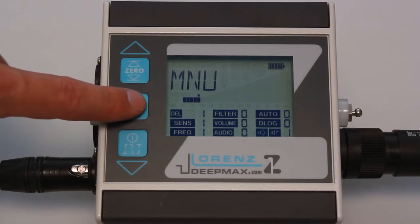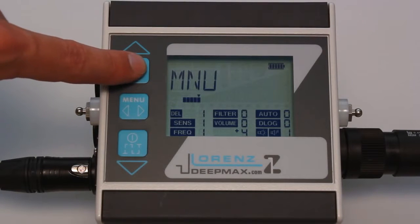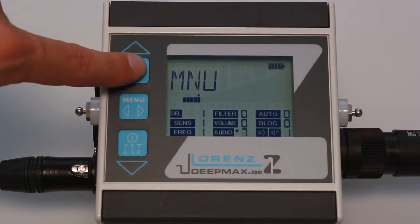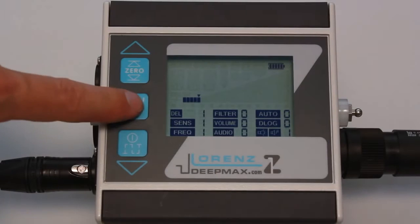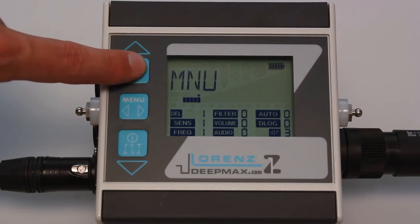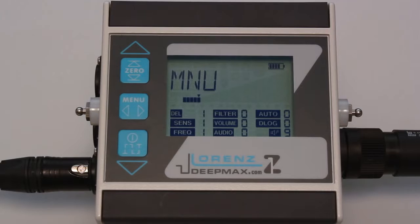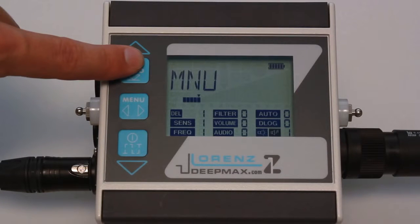The initial audio threshold can be altered from -9, silent, to +9, a low continuous threshold with the audio function. For most applications, a setting near 0 with a very faint response is perfect. Light adjusts the backlight of the display from 0 off to 9 bright. Tone provides a range of different audio signals depending on the metal objects.